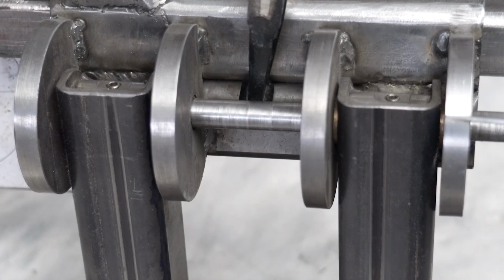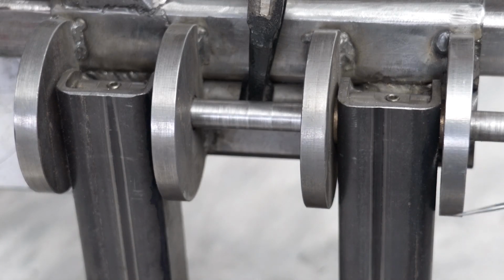Especially if you have a rotary table, you can just mill out these arcs, and so it makes it really easy. And possibly, if I was really thinking, I probably could have taken these and just cut the holes and put these on my lathe too, and just turned them as circles as well, using the hole with a mandrel. So that's another way to do this.